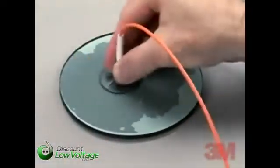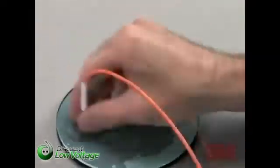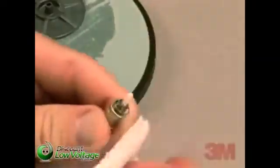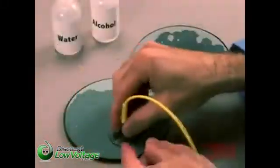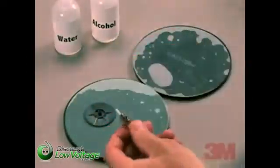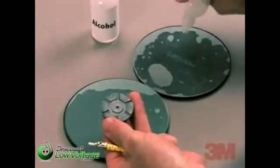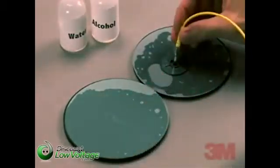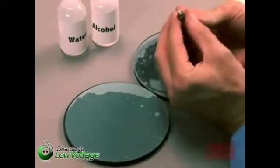Once you have finished the air polish, place two drops of distilled water on the pad. Place a sheet of 2 micron blue-green lapping film on the pad, glossy side down, and clean thoroughly. Place the polishing jig on the lapping film. Place the connector with the ferrule end down into the polishing jig until it stops. Grip the connector with your thumb and forefinger while gently resting them on the jig. Begin polishing with light pressure, moving the jig in a figure eight pattern. The speed of your figure eights should be between one and two per second. After completing five figure eights, increase pressure until all the blue adhesive has been removed from the tip of the ferrule.